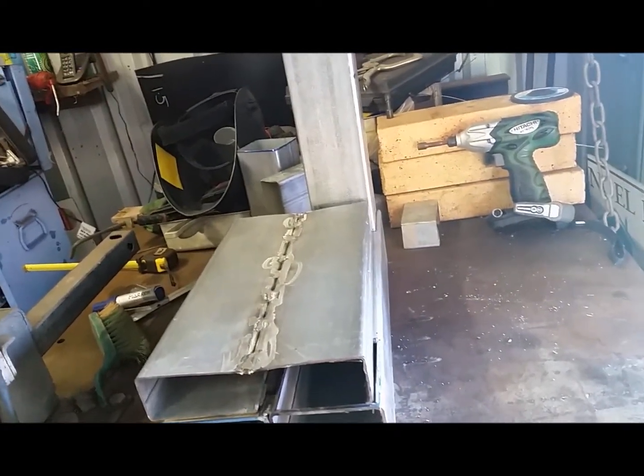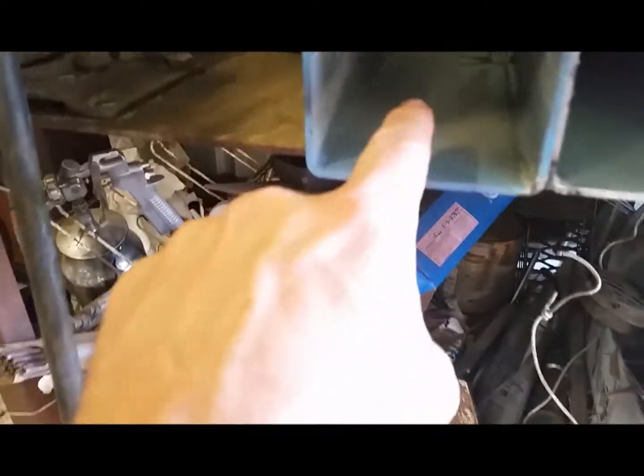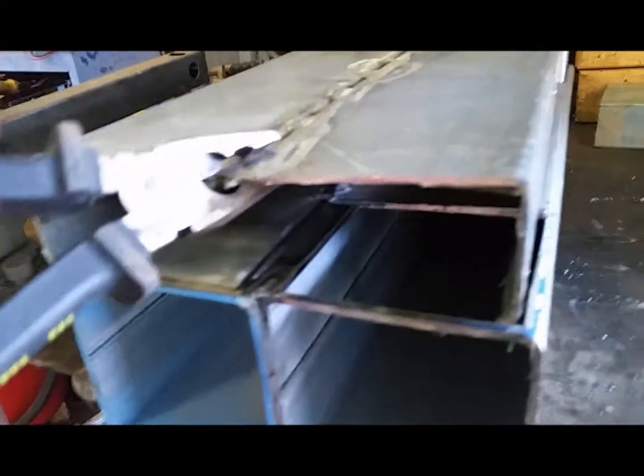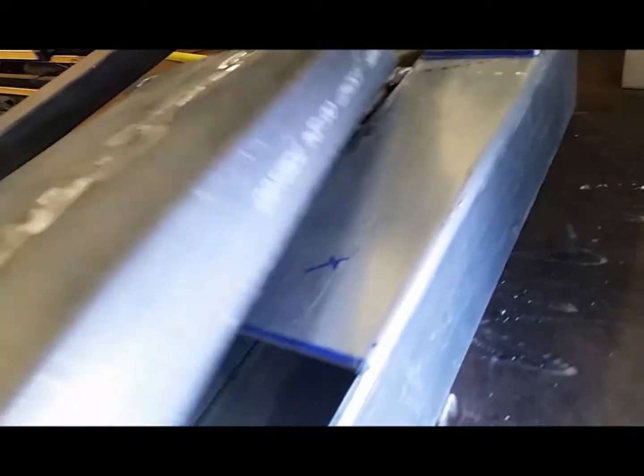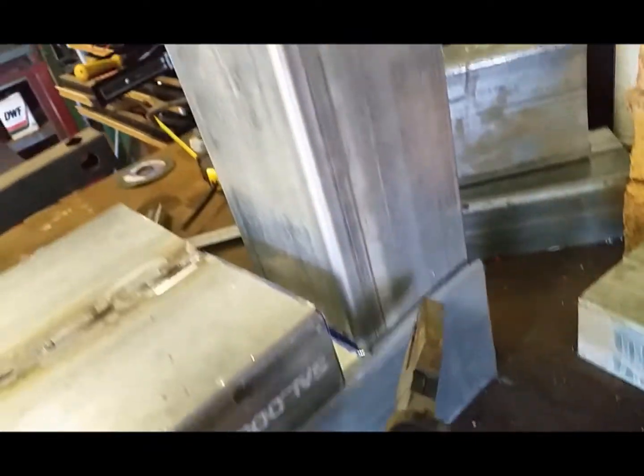I've kept all the chambers bigger, and I've reduced maybe 800 mils or about that of flue length. So pretty much now, this is the burn chamber. Will go in up to the back. Sorry, that's the wood feed. The burn chamber's there. It will come up into this notch. We'll then run along this tube across to either here, or it will come from this corner along this way and then down into this part. Then it's going to turn a corner and run down into this 100 by 100 square tube, and then up into the 100 by 100 flue.